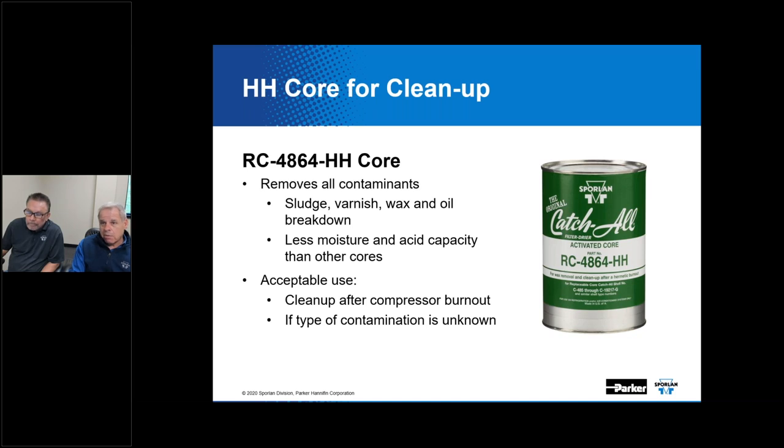Is a contaminant. And if it happens to be metal fines that are generated by, say, the scroll compressor that's wearing in like they normally do, that's potential contamination. I mean, copper chips, brass chips that might be left over from the manufacturing process from anybody that's supplied components is contamination. Drawing fluids, I mean, I don't know.